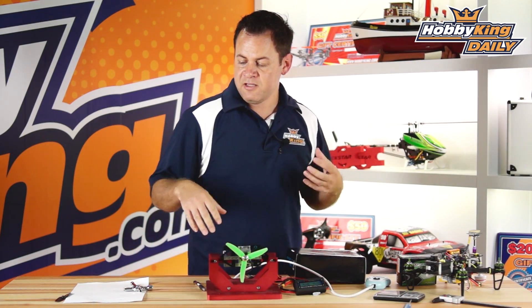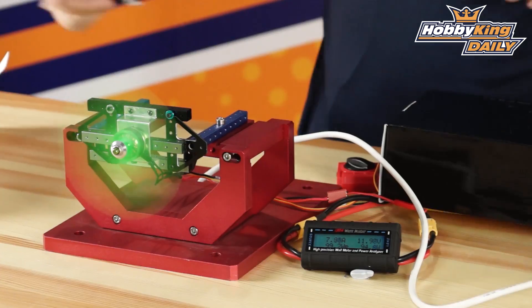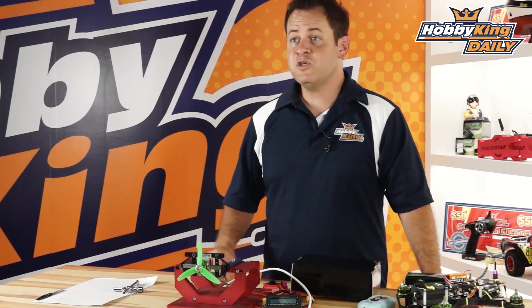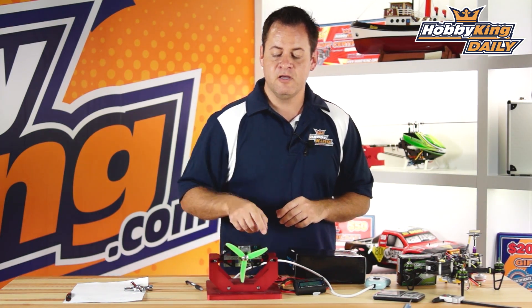With the three-blade plastic prop, in the hover test we're at about 2.9 amps — a little more, as expected with three blades being less efficient than two. At max power we're getting 255 grams of thrust at 7.7 amps. Times four motors, that's over 1000 grams of total thrust — that's two-to-one or better on most of these micro quads. It's a beast of a motor. If your frame can accept a larger six-inch prop, this motor will handle it quite well, since the 22mm stator has plenty of torque for a six-inch prop.